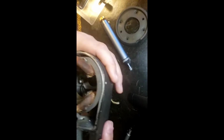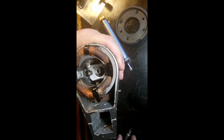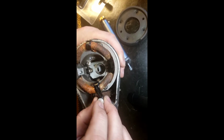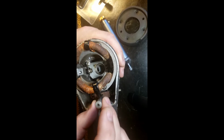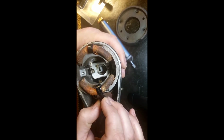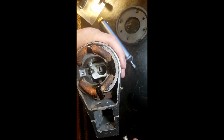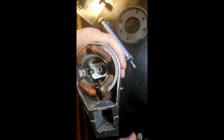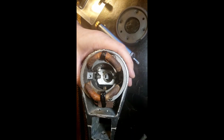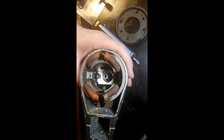So what I believe is when this head is lowered, this interfaces with either the jar or the edge of the heater, or probably not the heater. I believe it just interfaces with the edge of the jar and depresses that micro switch, and that's what causes the back and forth. Without that being engaged, it just goes a single direction so that you can then crank up the speed. For instance, like when you want to raise the basket up a little bit and spin out the extra fluid.